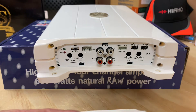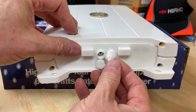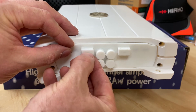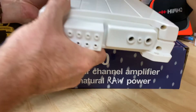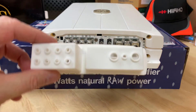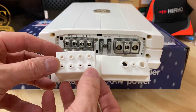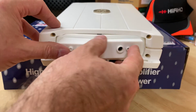Being marine, when this panel goes back on, these little panels pop aside so you put your RCA in behind. This slides through and clicks in. There are little slots here where cables pass through, so the whole thing's weatherproof. Turning it around to the other end — you take this big terminal block off and there's all your power cabling, remotes, fuses, and speaker connections. The fuses are protected. You've got holes where the cable, when fed through, seals off. They've done the same for your four speakers — one, two, three, four — and once your cables are fed through, the cover clicks back on. There's nothing left exposed to the elements.